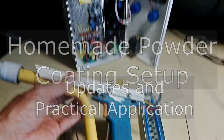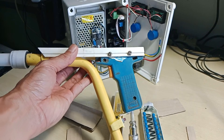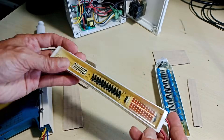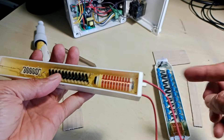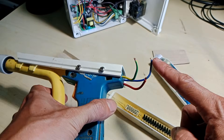As you may have known, this is the powder coating gun that I put together from recycled materials picked up from the trash. Some time ago, I was able to get my hands on this commercial high voltage cascade for powder coating. This particular cascade only has two wires — it does not have the third wire for the current sense as my existing homemade version.